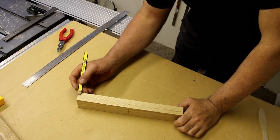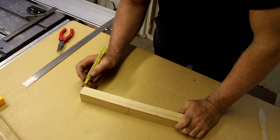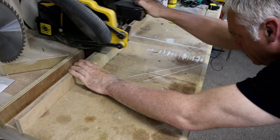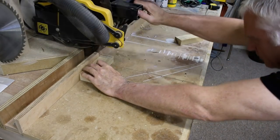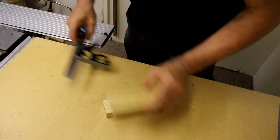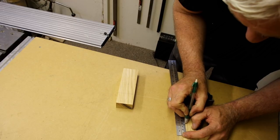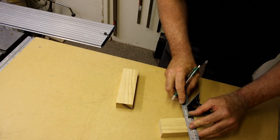I now need two pieces of stock measuring 50mm by 30mm — I need to cut two pieces at 145mm. Similar to the headstock where I had to cut a channel so it would sandwich over the bar, I'm going to make this channel just a little bit bigger so it allows the adjustable clamp to move up and down the length of the bar.